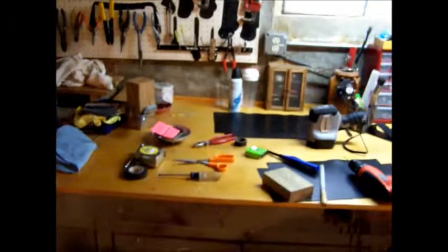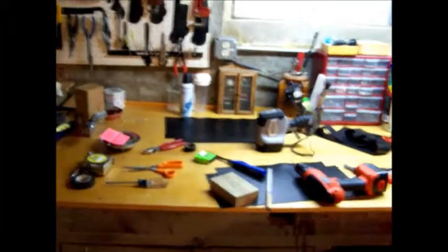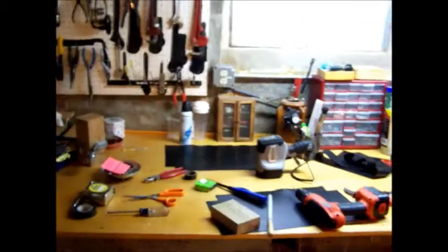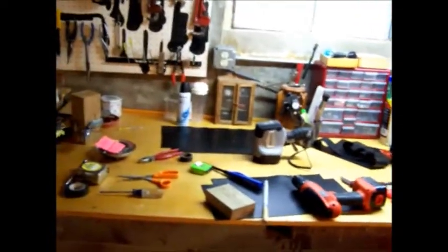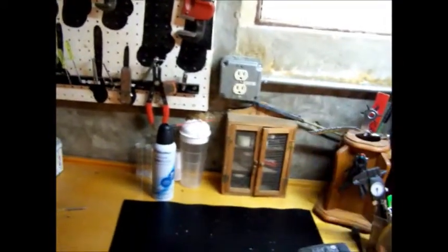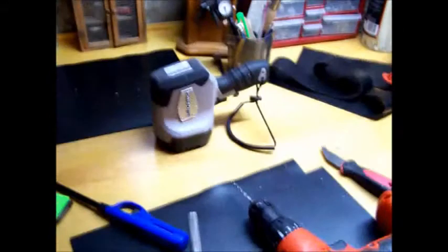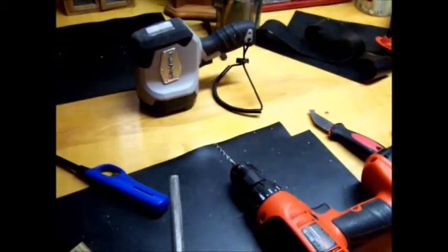Anyway, this is the mayhem left over from making my 10 meter antenna. It's a dipole. I used some solid copper 12 AWG wiring, ground wiring that I had left over. I used some fiberglass or plexiglass that I got for free. Used a fiberglass cutter to make it about 2 inch by 3 or 4 inch, drilled some holes in it to run the wire through and also the rope to fasten it.